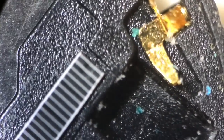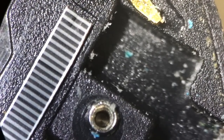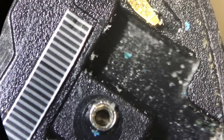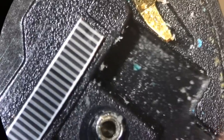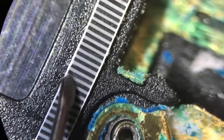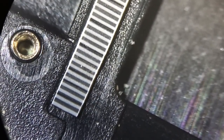While we're here we'll look at the zebra strip - it's very hard to focus using my mobile phone on a bracket hanging off the microscope. We'll look at the zebra strip just to see if there's any particles or damage to it. Sometimes the battery acid gets onto this as well so you've got to clean all that off. I wouldn't expect to see much on the other side.